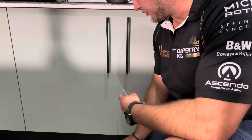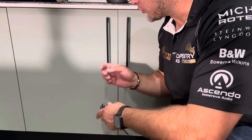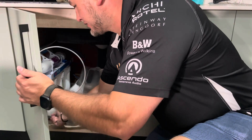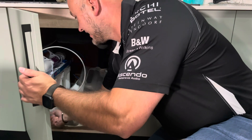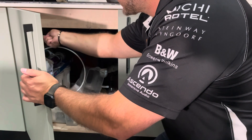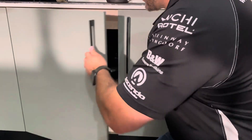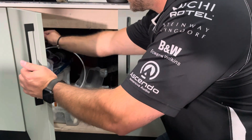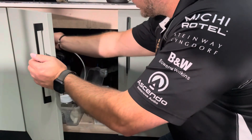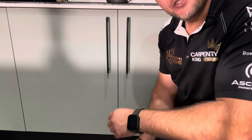Lastly, the pesky doors by the sink unit that get used the most. I promise you if you are looking for a sagging door it's always going to be here. I can feel this side needs to go up a bit — excuse the mess, it's always the sink cupboard, it's the messiest. So we adjust that one out, we can adjust the top one back a little bit so we can just get that gap. Top one back some more. There we go — a nice even gap again. Small little micro adjustments. And you do that for all the doors.